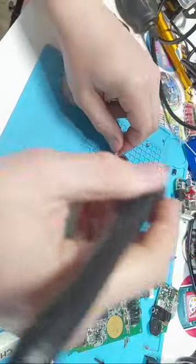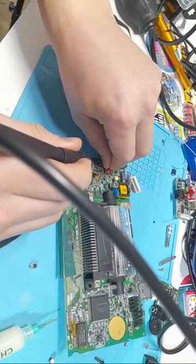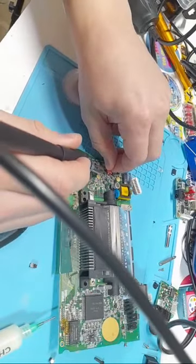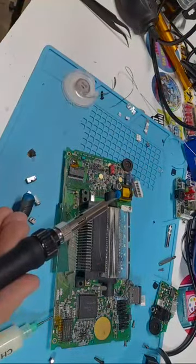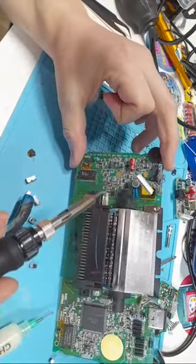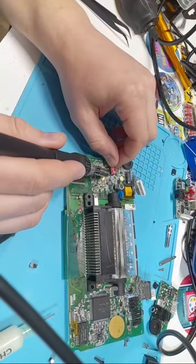And again, the same thing. Now this is a little bit harder to solder too, and it's easier when I have longer legs, but yeah, I think these legs are a little bit too short. That's why I was hesitant on cutting them originally, but yeah, you solder that, and that is probably the ideal way to save space because you can move it any which way you want. But yeah, that's how you solder on the electrolytic capacitors.